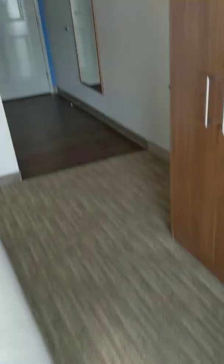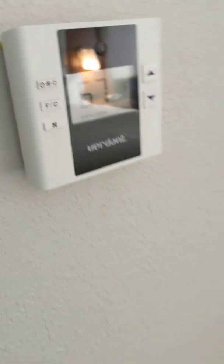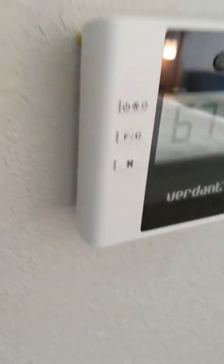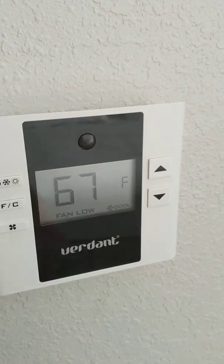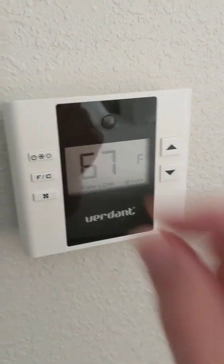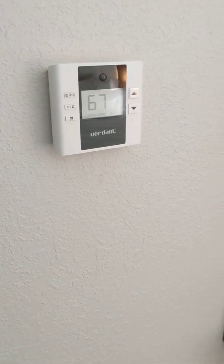I like running into these if they're in good shape and quiet in the room at night because of how easy they are to override. So that's your tip — you don't even have to monkey around with a pin or a reset button or exposing a circuit board here. Just go to the Amana unit and override it. But sometimes these are connected to different wall units, so then you have more problems and you actually have to unscrew this and go in there. There's a little reset button you have to use a pin for. There's a pilot out there who had a video of this on YouTube — he put his Delta pin in there and hit the reset button, there's like a little pinhole, you can do it with a paper clip too, but you've got to get the outer cover off first. Hope you guys find these helpful and can save a couple of you from some too-toasty nights.